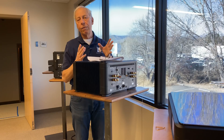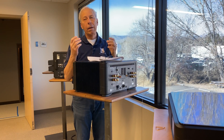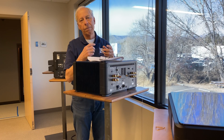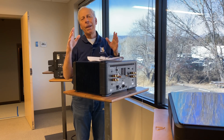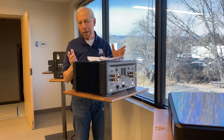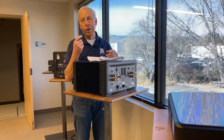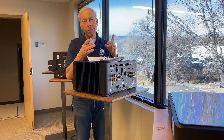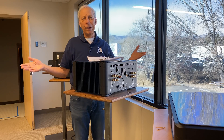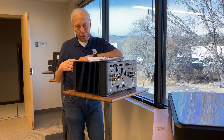That straight line is full of high frequencies at high power, and high frequencies at high power can damage a tweeter. And don't get me wrong, this isn't always true, and it's less true today than it used to be. Tweeters used to be very delicate with no protection, but today many tweeters have polyfuses and other things to protect them. In any case, you don't want to listen to clipping anyway — especially at higher frequencies, it can sound pretty nasty.